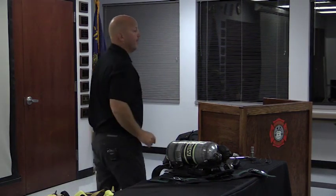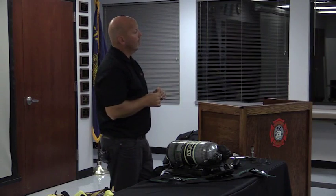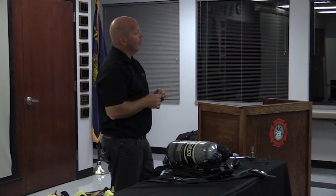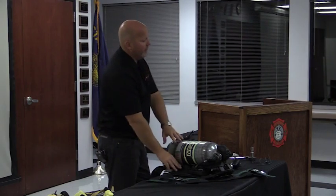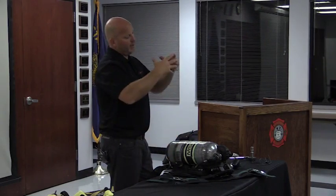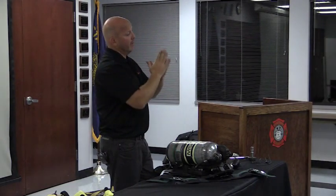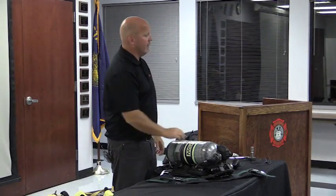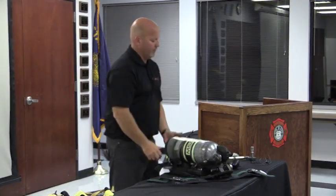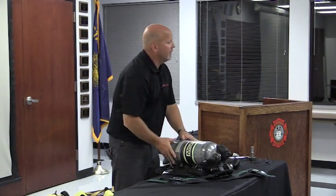Going back to when you were talking about depressing it to fit another bottle, is there any chance where that can get hit and your bottle would come out? Anything's possible. The thing is you have the dovetail holding it, and if that came all the way out, it would still hold the bottle, but it would not be snugged into it. Your bigger issue is that this comes loose here, and you have this situation, if you follow me. Your bottle's still retained, but it's not snugged onto there.